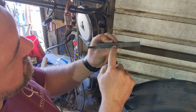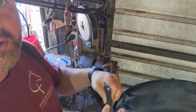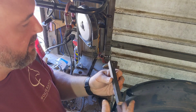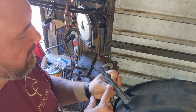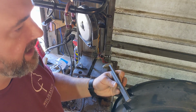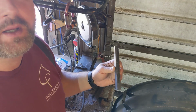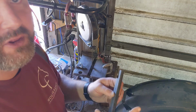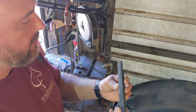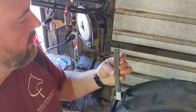And both those cuts cross over each other, and that is what creates that really neat diamond shape in the middle. If you didn't want that diamond shape, you could just cut them shorter, and you could make it so that there was just a blanked off space there, or you could drive a drift down there to round them out and make them more like a Celtic kind of cross. But that's the basic blank that I use for mine.